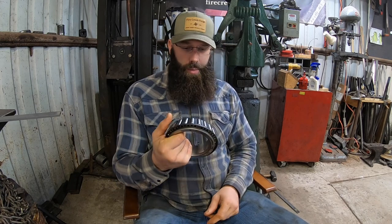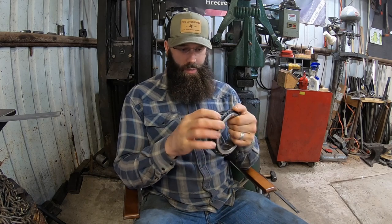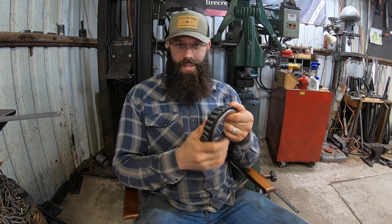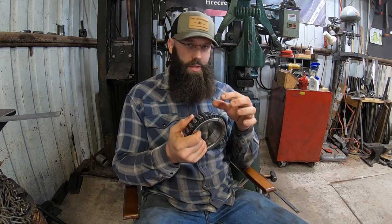It's an opportunity to look at the characteristics of 52100 steel. Think about a bearing: it's got load, pressure, weight. There's an outer ring, your rollers or ball bearings, and then the inner ring — all of those main parts are typically made from 52100. You've got weight on this assembly; it has to be able to resist deformation. These rollers right here, you can't have them squishing — that's a technical term: no squishing. So it has to resist deformation. That's strength, a key characteristic of this steel.